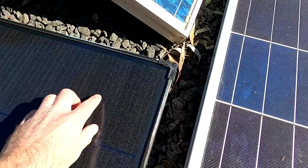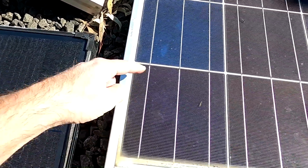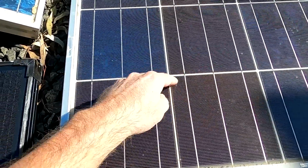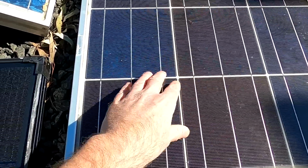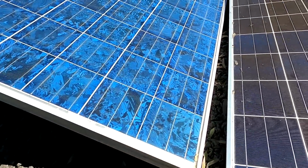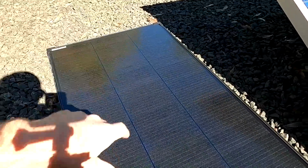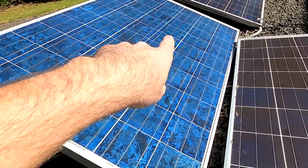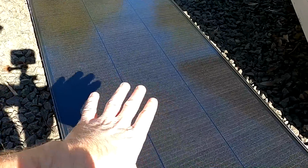Obviously there's no space in between the solar cells as we have here. See, we've got these white spaces in between the single solar cells in the panel, and this obviously results in loss of active area, because here we have only these small gaps, 2 of them the whole length of the panel, while here we have them all in between these single solar cells. So apparently these ones are far more efficient here space-wise.